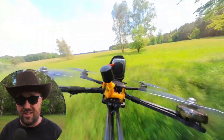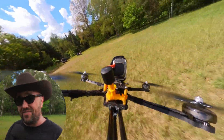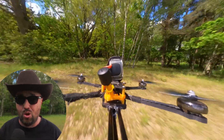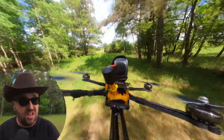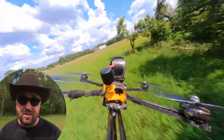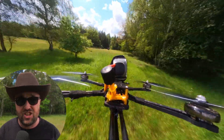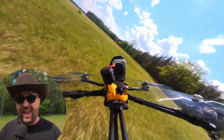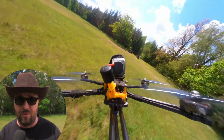And of course, I had to adjust the filters and the PID setup on the flight controller. The quad usually flies with the gyro filtering at around 110Hz. To have this thing hanging from the back, I had to lower the gyro LPF to around 70Hz to try to filter out some of the vibrations still fed to the gyro. I also had to seriously lower the P and D gains on the PID controller — I just cut everything in half — and only then I was able to have stable flight without too much vibration.